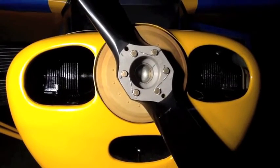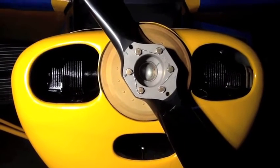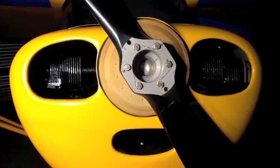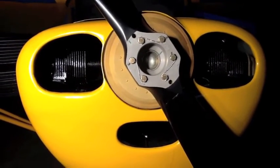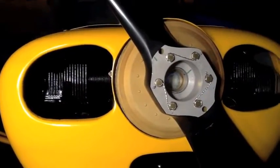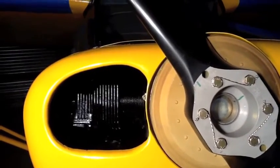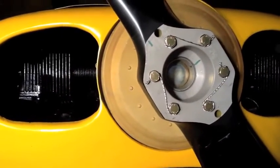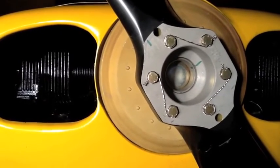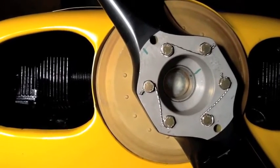The ratchet wheel and spinner back plate are now fitted and the prop is back on, using of course longer bolts which have to be very carefully measured to make sure that they don't bottom out against the propeller flange. The all-important one eighth of an inch clearance all the way around the starter is checked and okay. This can be difficult to achieve with some nose bowls as they are all many years old and have seen many vicissitudes in their lifetime.